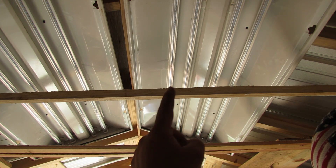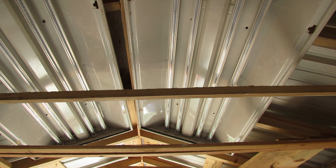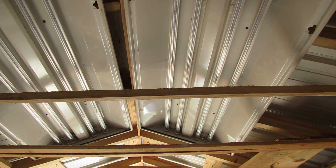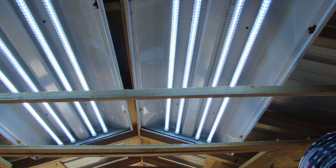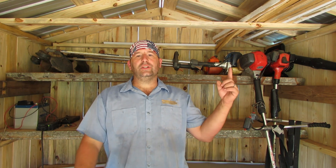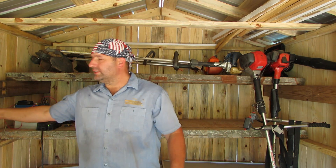Got the lights installed up here, they look pretty good. I went ahead and wired them up — just daisy chained them together, black to black, white to white, and hooked the grounds to the chassis. Then I've got them hooked up to the inverter. Let's go ahead and turn them on and see what happens. Nice — they all turned on, that means they're all connected. Just like that we got some lights in here — that's a huge step forward for the Chainsaw Hospital and Dr. Cutter. Let's turn these lights on and see what it looks like — wow, awesome! Thanks for watching and we'll see you next time.